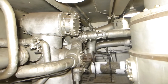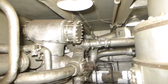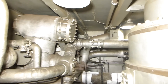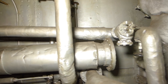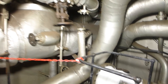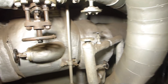We're currently standing at the forward end of the upper grate in the starboard engine room. There are three separate levels in the engine room; the engines are quite tall and a lot is happening on each level. What we're looking at here is a lot of large piping — this is where steam comes into the engine room. Outboard here, on the outboard bulkhead, this extremely large pipe is the incoming steam main, where steam comes in for the engine.